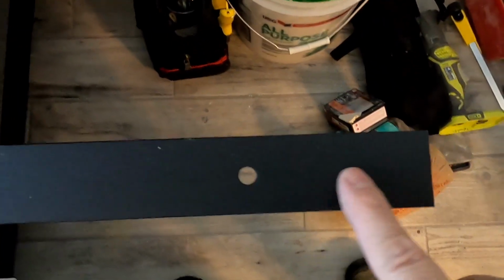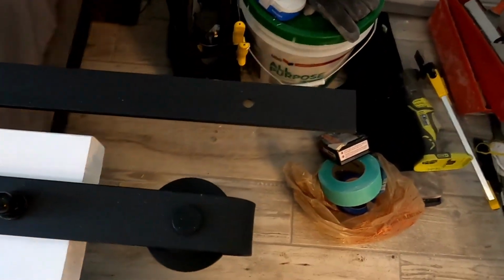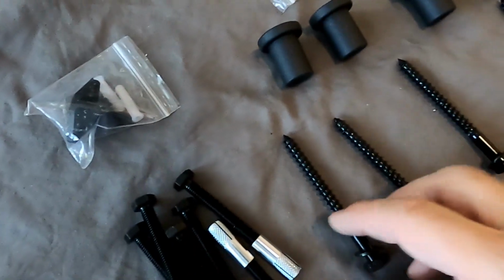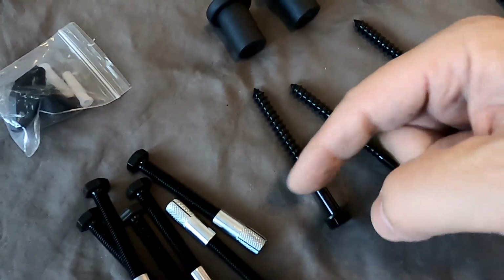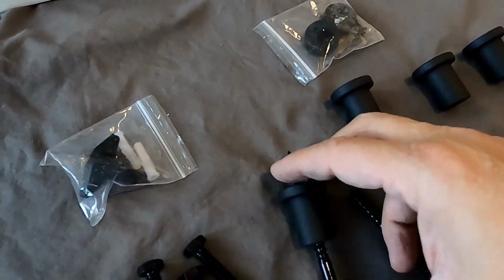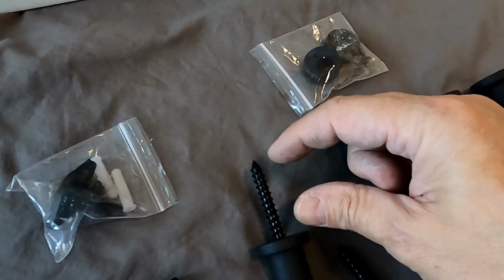And so the next step is to put the rail up, and because they offset, you won't have to worry about them hitting these other lag screws. So I'm going to use this rail here, and it goes 3 inches off the edge, and I'm just going to put this to the edge of the wall. And then this is about 22 inches. So I did measure. None of these screws are going to hit or line up with the other screws. I'm going to use a drill bit and drill 6 holes, and it will go lag screw, washer, then the rail, and these knob things, and then this will go against that white 1x4. So it'll stick in the wood about that far. So it'll go a little bit more than the 1 inch.